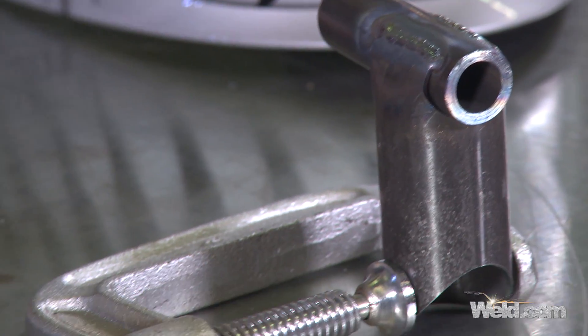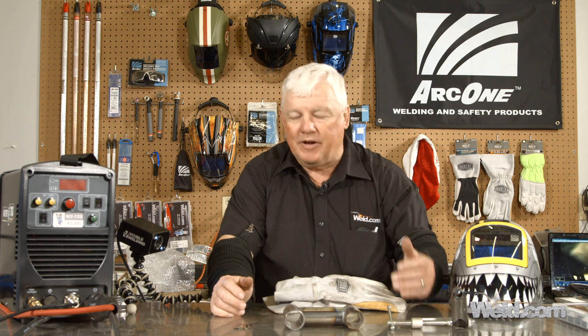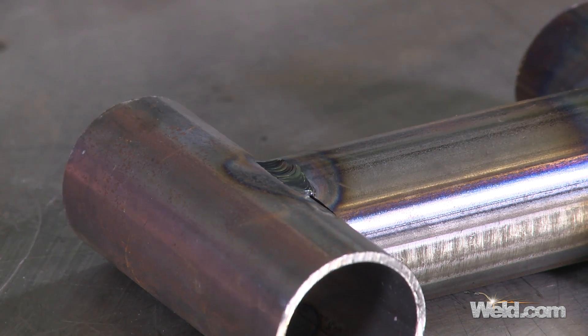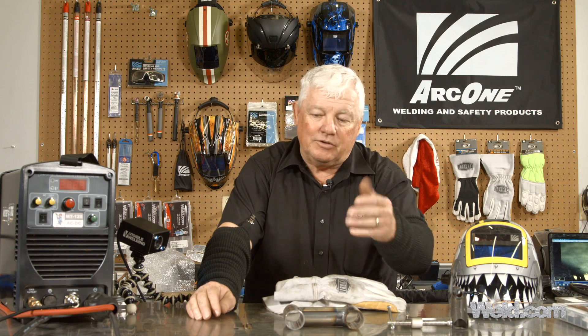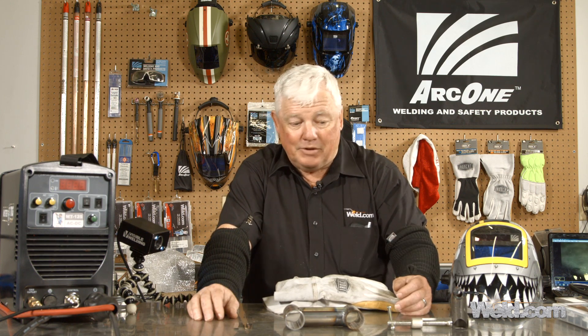Then I moved over to what I call the NHRA frames — 083 to 094 wall. I just welded a small segment here. This is not designed for full-on fabrication; it's for repair in the field, one-off type work, wherever you only have 115 volts. I used somewhere in the 90 to 95 amp range on that. I started off and held it at about 5 to 6 amps — this machine lights off pretty low. When I ask for changes in these machines, they get better and better. That wraps up the DC side, and I'm pretty tickled with it.